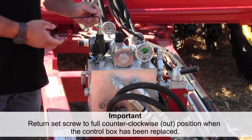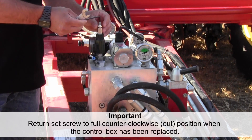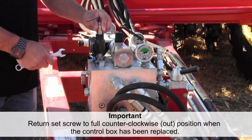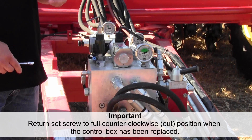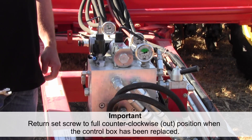However, if you do happen to do this and then get your box repaired, make sure that you screw this all the way back out and jam the nut down and plug your wire in — otherwise you will not get the full range of pressures from your switch box in the cab.